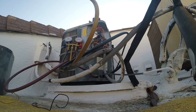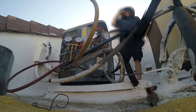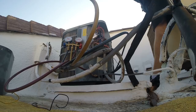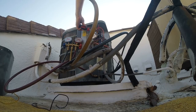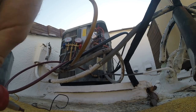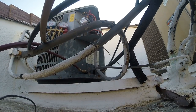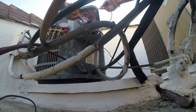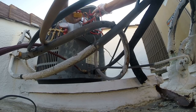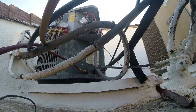I don't feel much heat coming up the compressor. We discharge, tighten up those leads a little. Discharge our capacitor again. Go ahead and test that hard start kit. Seven microfarads. This lead seemed a little loose as well. Here we go. Let's see what we've got. 48.1, so that's good. Okay.